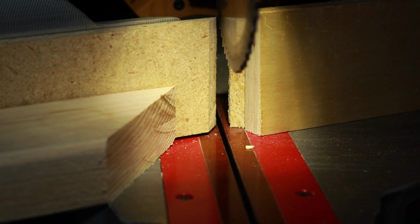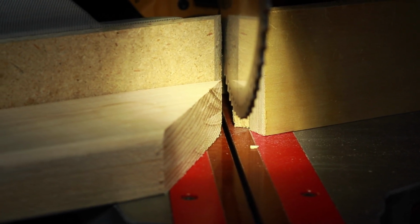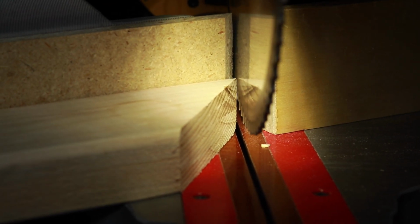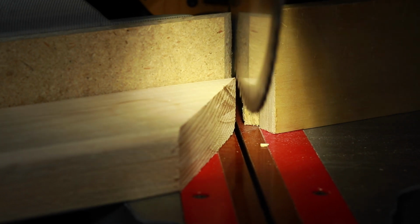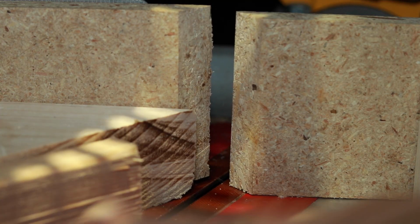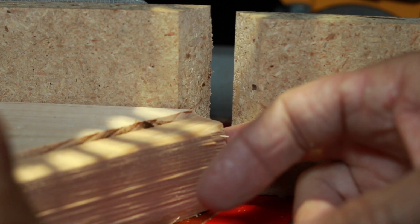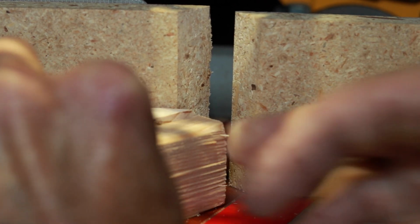With the miter saw set at 25, take the piece that you cut at 45, bring it to where the tip just kisses the blade. Once it just kisses the blade, clamp the piece of stock down right there. Now take your stock, and slide it in till the corner of the stock gets flush, or even, with the tip of the 45.